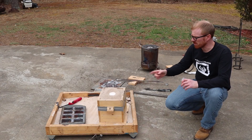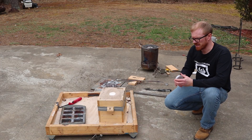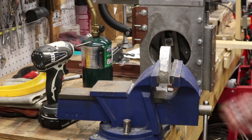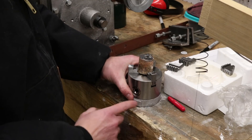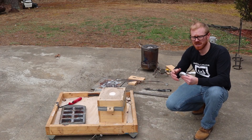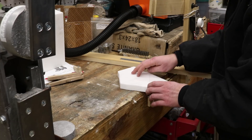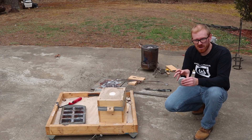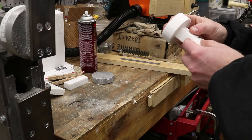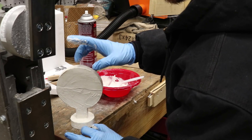I made a new pattern for this adapter plate for the chuck, because the first one I cast is really too small. After I got it cut up and compared it with the chuck, I decided the fasteners for mounting this adapter to the face plate need to go on the outside of the chuck. There's just not enough meat, because my face plate has four holes and the chuck has three mounting holes. To orient that without interference, it really doesn't leave enough meat for the face plate. So I've made a slightly larger disc pattern to cast in aluminum.